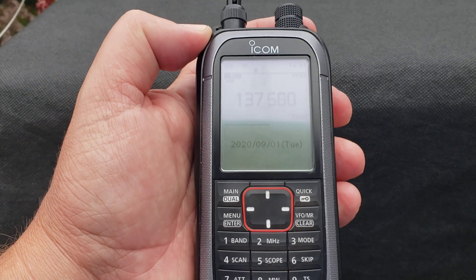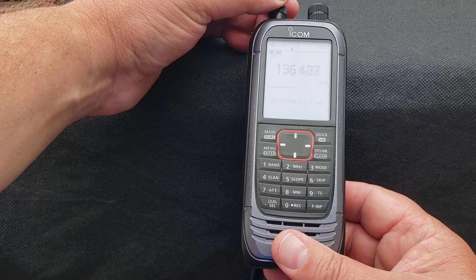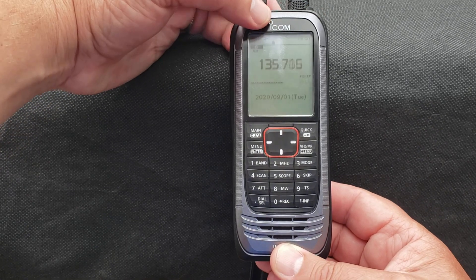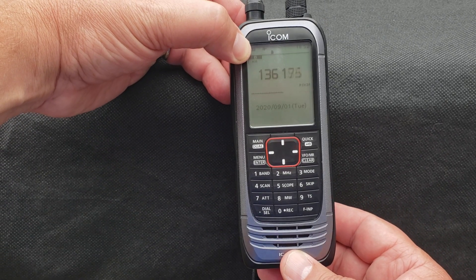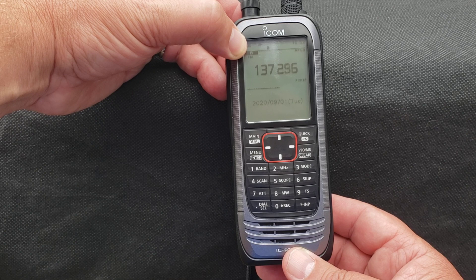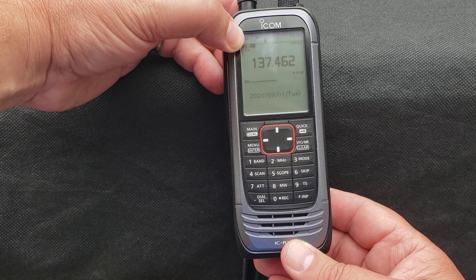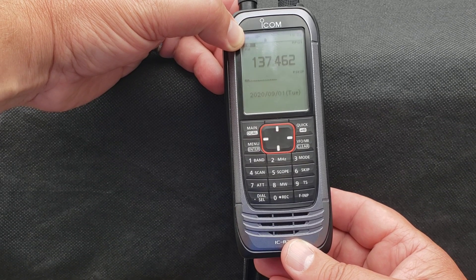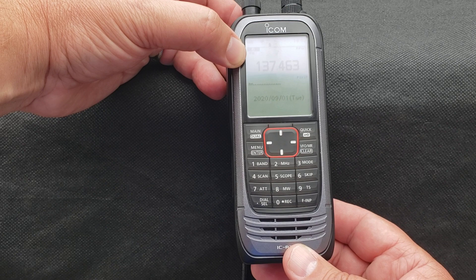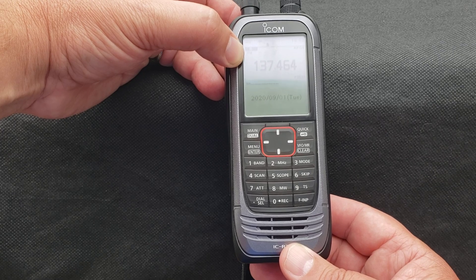Try to identify what you're listening to. The trick is to make sure that what you're hearing isn't a local interference signal, because that can happen — for example, on 137.700 MHz I usually have one. Satellites won't last more than about 5 to 15 or 20 minutes maximum. If it sounds like a digital hash, for example, this is possibly an Orb-com right now. I actually recognize by ear the digital signal that an Orb-com is sending, so this is an Orb-com.